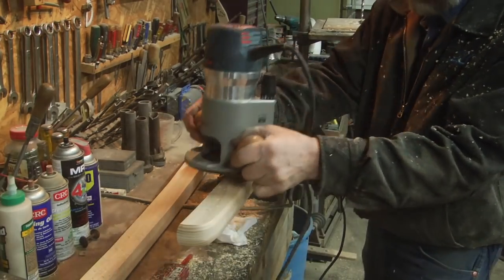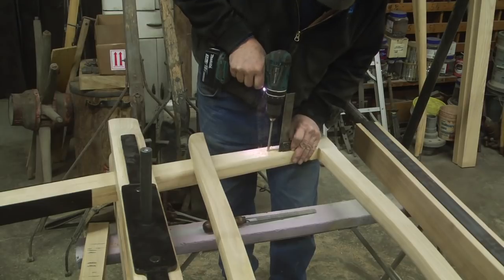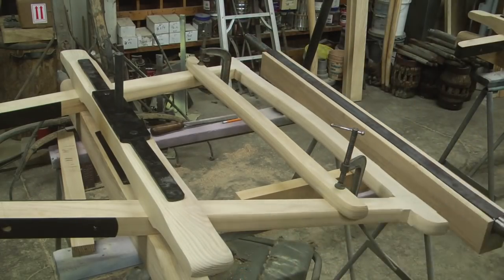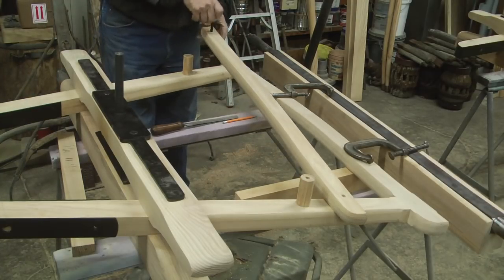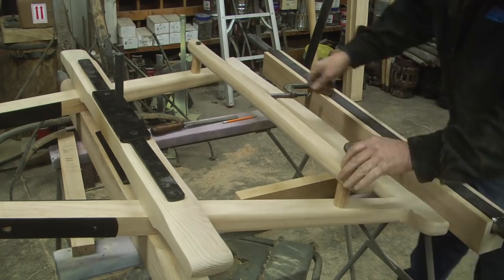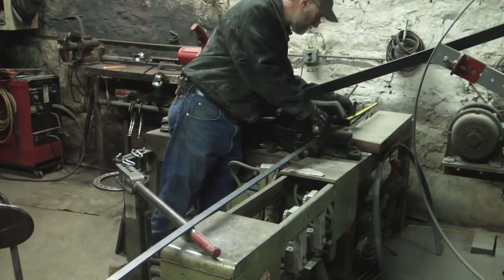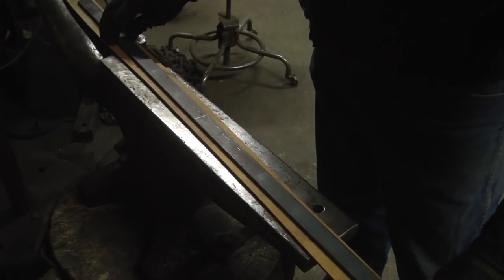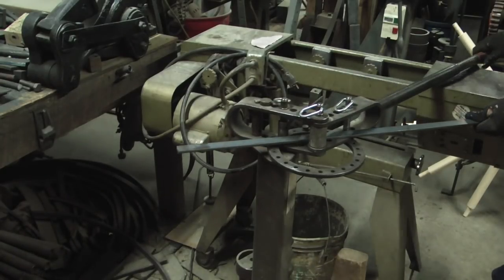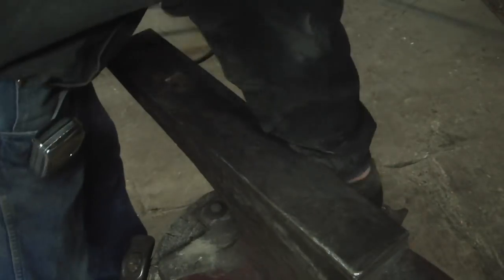These two bars that go across the back of the axle hound are what actually sandwich each side of the reach and help stabilize the front axle. Therefore, we have an upper stabilizer and a lower stabilizer. Both the upper stabilizer and lower stabilizer get a flat strap that takes the wear from the reach.